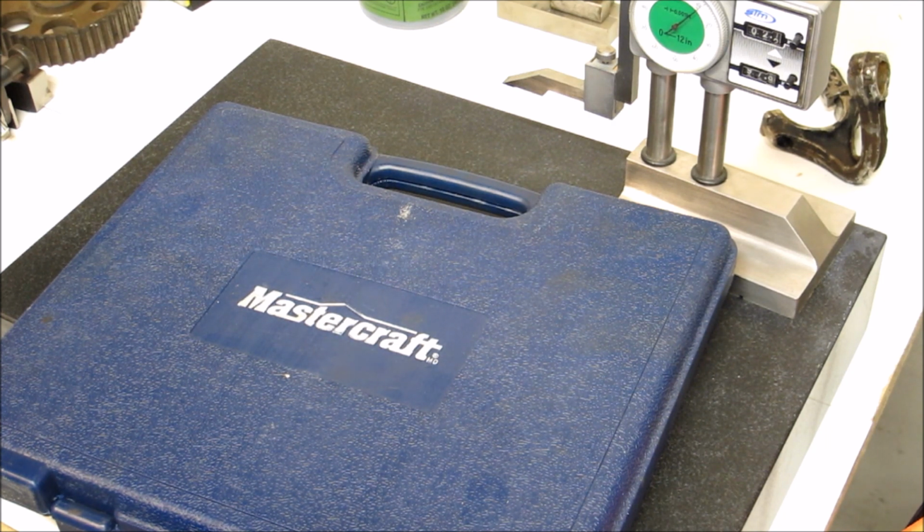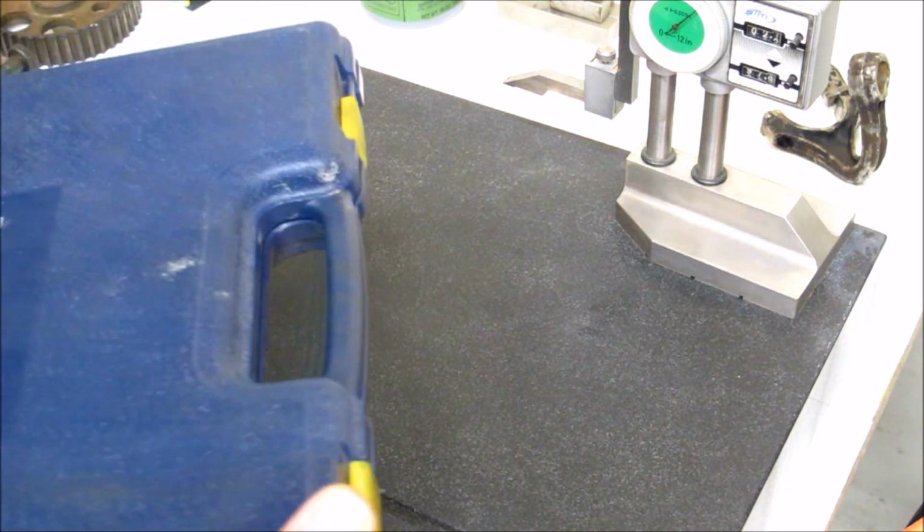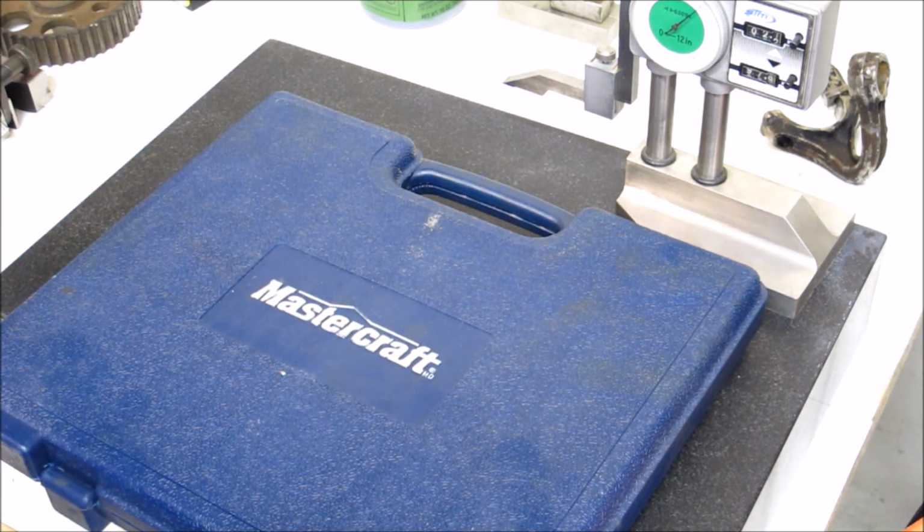And it's really cheap. I think this thing was under $50 for a full set of standard taps and dies. But you'll soon find out that they're essentially barely adequate for cutting threads in things like brass and aluminum. You might get by in a free cutting steel with them. They're terrible in anything else.